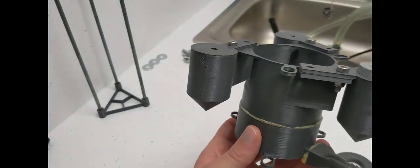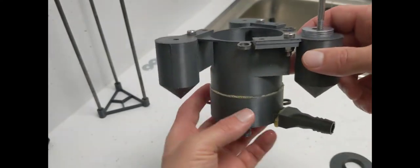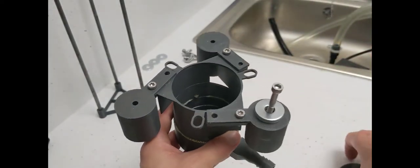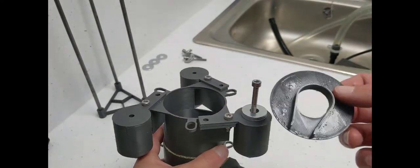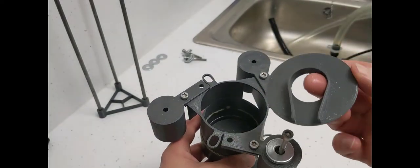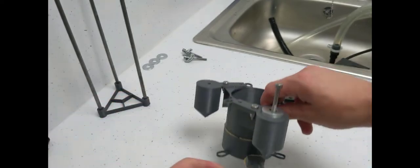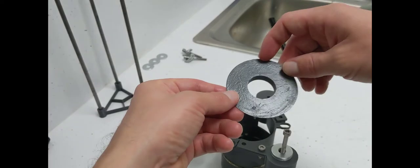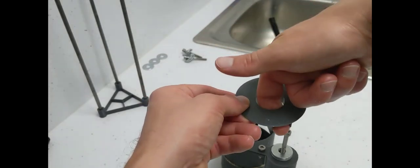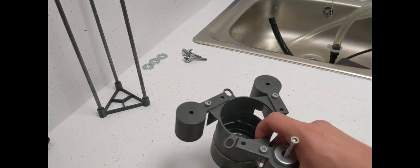It works similarly to the triangular version: three inlets around the edge, a bottom piece with a spout to the side, an insert, and the floats. The insert is key — coolant comes in as with the triangular piece but it's circular this time, giving a strong vortex. The insert flips over and lines up with the spout, so the vortex goes straight down through the middle and then does a right-angle turn out through the spout. This means you get a really good vortex going straight down the middle, and then suction comes in rather than pulling the vortex sideways and killing it like in the other version.